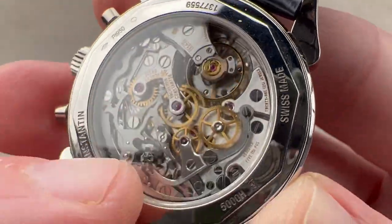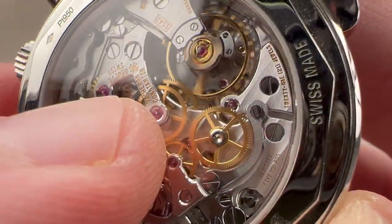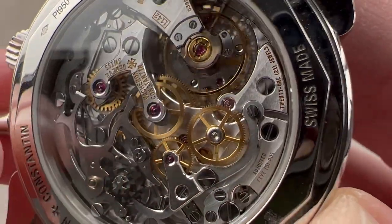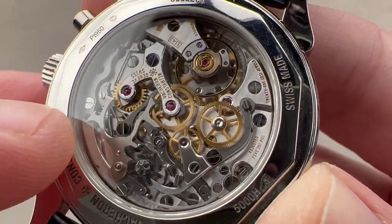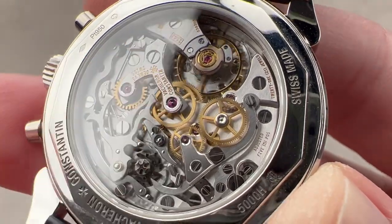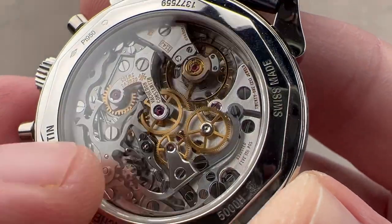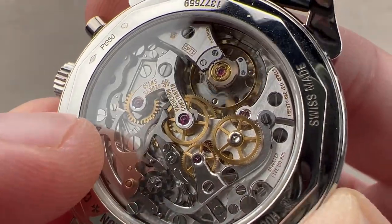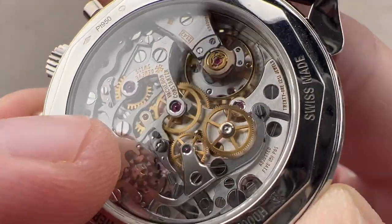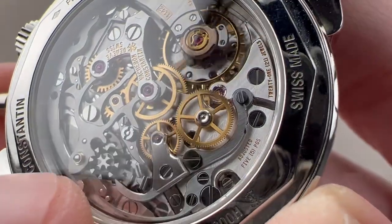Geneva hallmark, and that's reflected in the execution of the mile-wide bevels. We have 1, 2, 3, 4 interior angles that I can count, and they're nicely executed, and that's where 2 bevels meet in a sharp cleft crease. We have steel components for the chronograph, the yoke, the column wheel, the levers, horns, the resetting hammers, and they're all satinated across their top, and then beautifully mirror beveled on their sides. Not easy to finish steel like that.